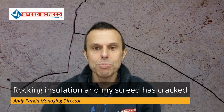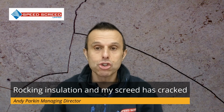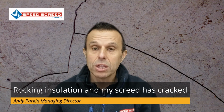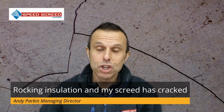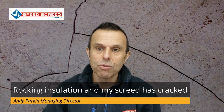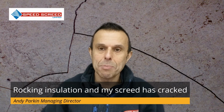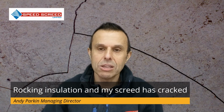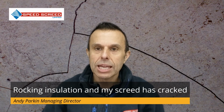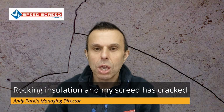But if you've still got movement or issues with the substrate, then you're probably just storing up those problems. You may repair them and it may solve the problem for a short while, but you're going to be revisiting those issues further along the line. And it's not just the screed, it's the floor coverings. If you're using ceramics or sticking anything to the surface, that's going to cause problems. So you've really got to deal with the issues that are there.